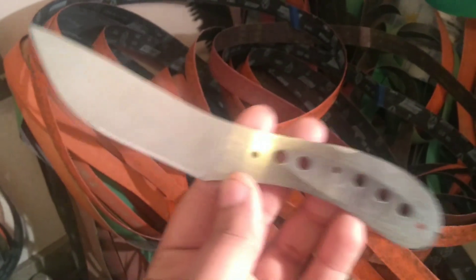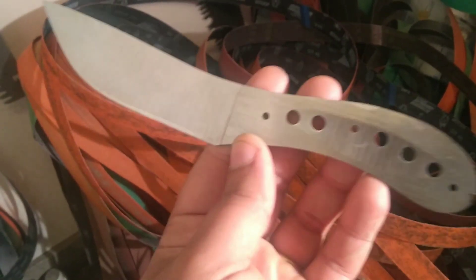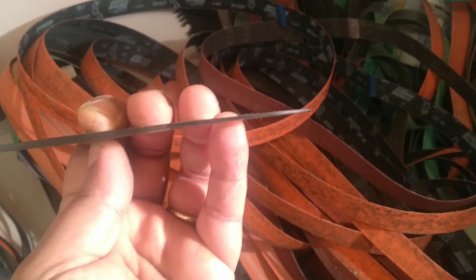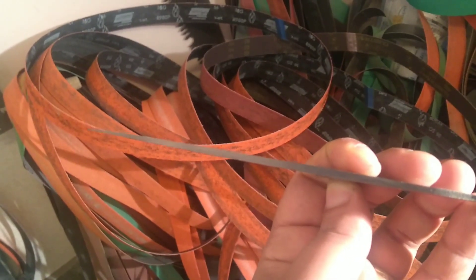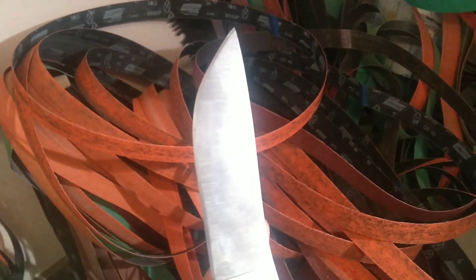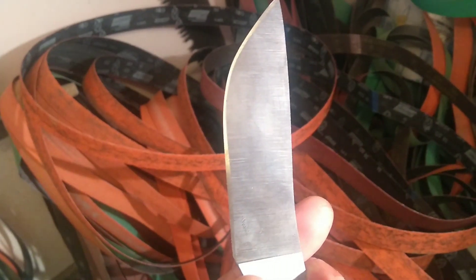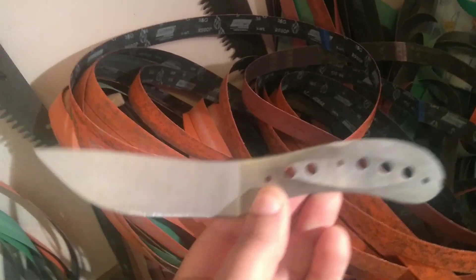REX 121 at 70 and a half — this has got to be the hardest knife I've ever ground. It was a full 150 thou stock and we did a needle taper. We have to do some finish grinding on the blade here — we're about 25 thou behind the edge. It's a really low edge angle, like 12 degrees per side, but that's a huge bevel.